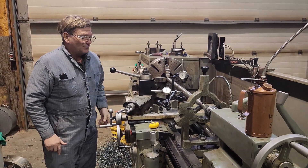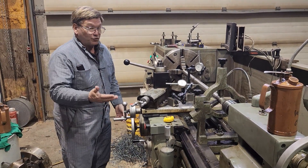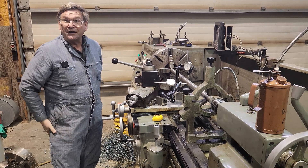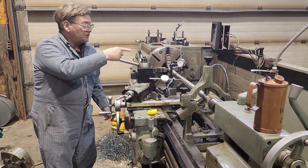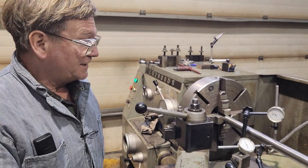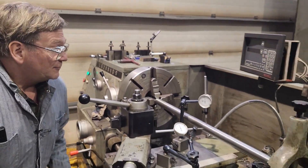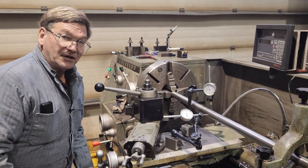The way to check if you think you might be having problems with that — while it's not common when you set things up correctly — you could have problems if your tailstock is off from your headstock. With the tailstock off from the headstock, you're going to adjust for your incorrect height at your tailstock, and then have problems with it walking out of the lathe. The other way you check that is with two indicators. You could use just one and move it to two different places, check one and then check the other. That's what I would have done 40 years ago when indicators were $200 a piece, but you can buy them today for $30. The stands are about $100 — that's the expensive part. And you've got to check both directions: up and down and in and out both.